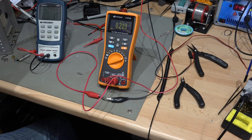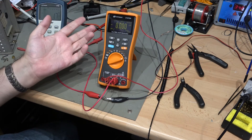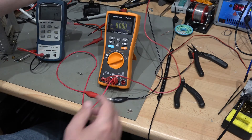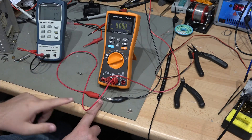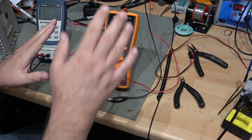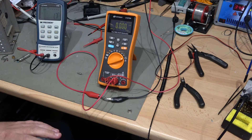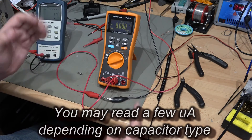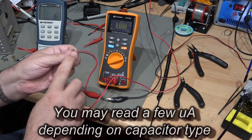Let's take its counterpart — a good one. We turn it on and we see a little peak of current, and then it vanishes. What I've got is a 35 volt power supply: positive coming through the positive of the meter, out through the meter, through the capacitor, and back to the supply — measuring series current. It should read nothing. Anything it reads is leakage. It might flash between zero and one due to noise and sensitivity, but it shouldn't read several milliamps continuously.